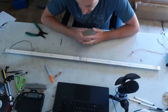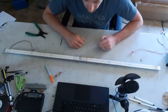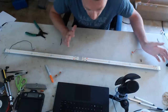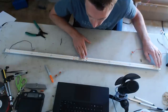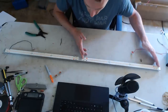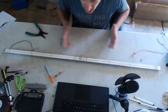The 600-54 is one of the few drivers that can run up to 16 strips — eight heatsink sets or 16 total strips — off a single driver. There's really one building block that needs to be done to make that work, and then it's very scalable. The photo boost strips we have here are 20–27 volts nominal, sometimes a little more or less, but basically 27 volts.